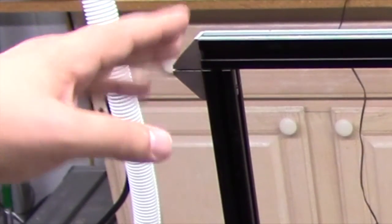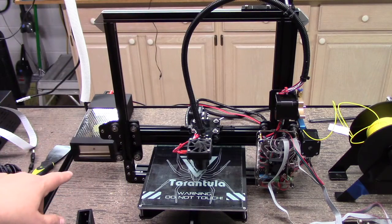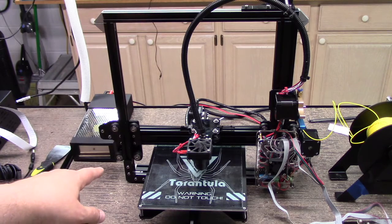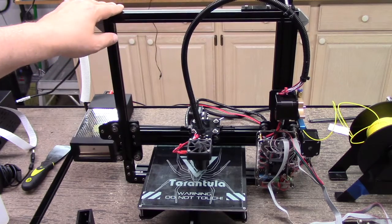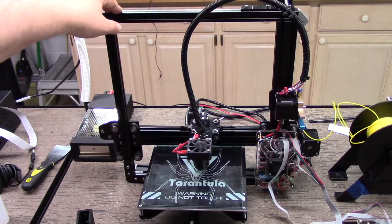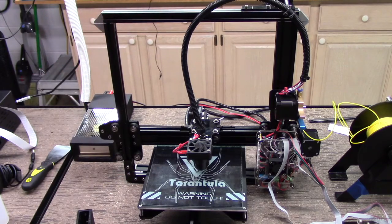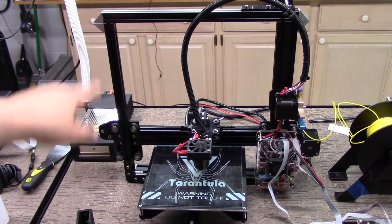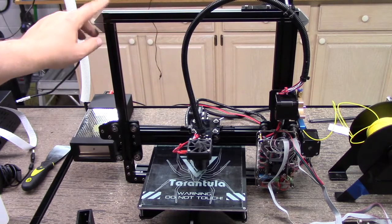What I've done, and we'll go around the back in a minute, is I've done a similar thing down there mounting the 20 by 20 single rail to the 20 by 40 double rail. This has added a lot of rigidity, because the flex you're seeing is actually the table moving rather than the gantry. I've also moved one of the corners that was up here down here, and once I've added these it's just unbelievably stiff.